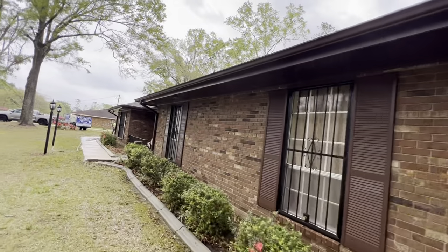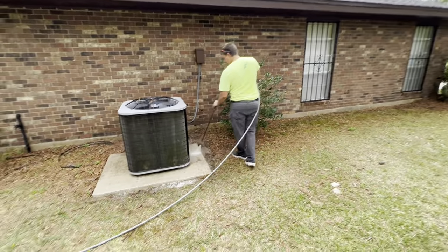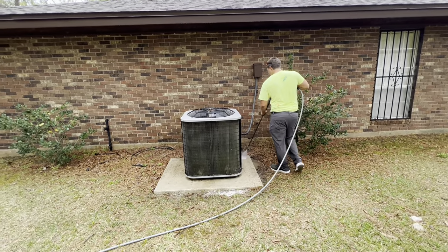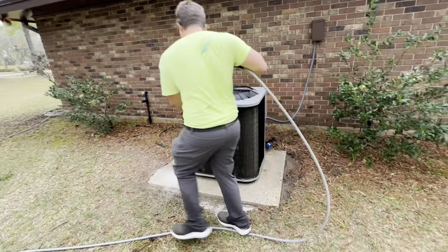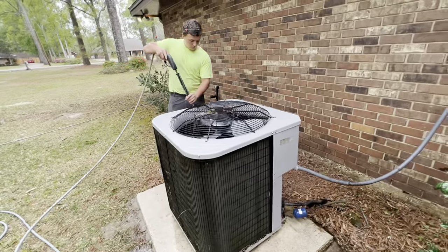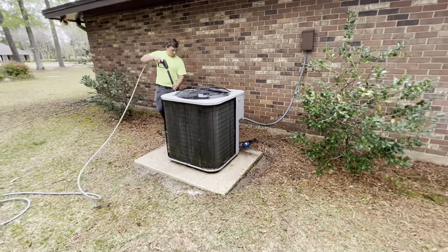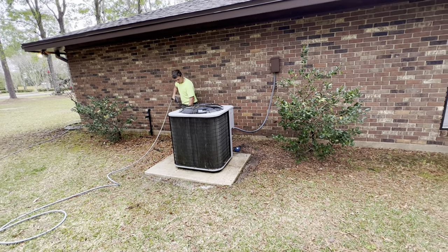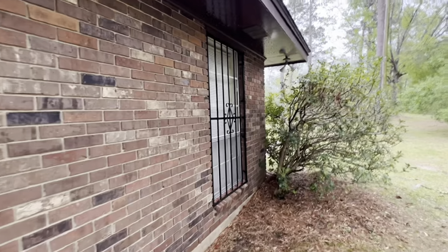Our solution is still dwelling. We're back around getting ready to rinse. Let me show you the AC pad — remember these coils are fragile, so don't put pressure into the coils. We do want to clean up the pad and inspect it — make sure there are no ants clogging anything that we might need to bring to the homeowner's attention. Then we're going to start rinsing the house and show you how to rinse these windows properly.